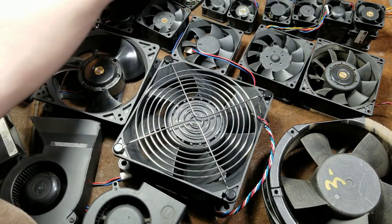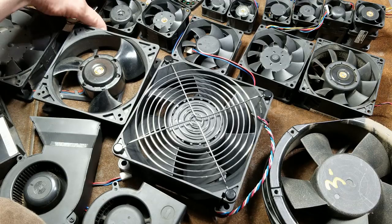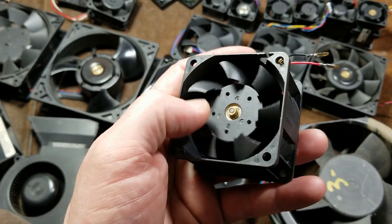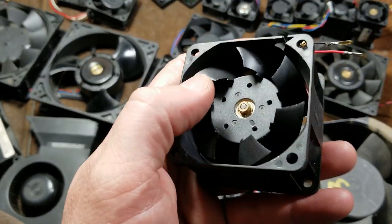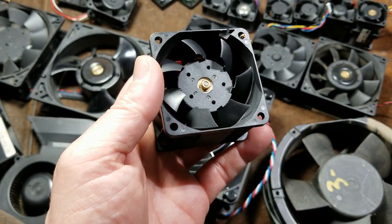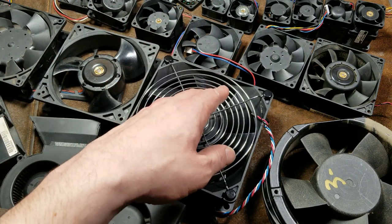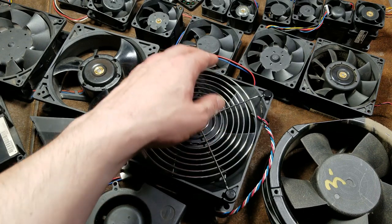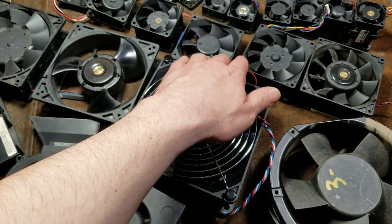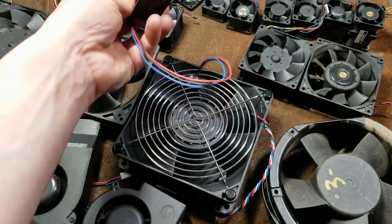This is just another 40 millimeter, and then you get up to 60 millimeters — the deal is you get up to a larger diameter and then you can get various thicknesses for different levels of performance. The next video I'll do quickly will involve a lot of these same fans, but it'll talk a little bit about the vane or the aerodynamic design. So many different designs out there — they're all extremely complicated. Every one of these fans has been modeled in computational fluid dynamics and they keep on experimenting, especially Delta.